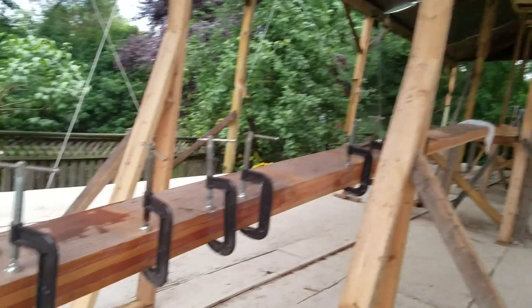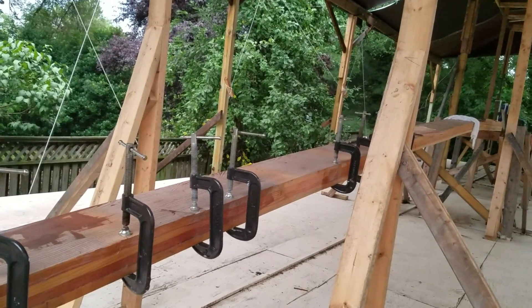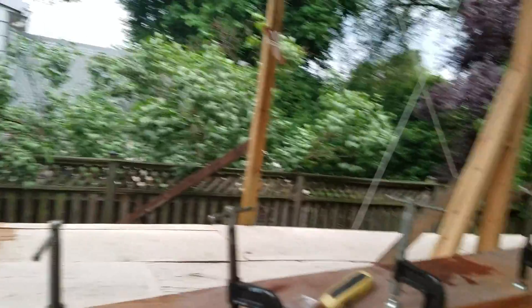What we have to do next is get this perfect. I want to sand it. I have to turn it over, because right now it's upside down. I have to put on these boards that will allow me to clamp the frames on — the boards get clamped and screwed to the keelson to give a nice strong mechanical and chemical bond. The section down there is a thicker section, 4 and a half inches thick. I have a bunch of 3-inch clamps, and I need about 7 more 6-inch clamps, because you've got to clamp an entire span where you have any gaps. Once you get one closed, you want to make sure the gap is all filled with the thickened epoxy so you can get good adhesion.